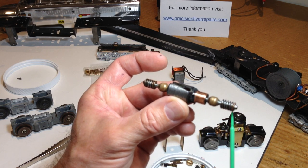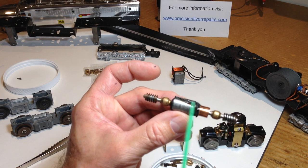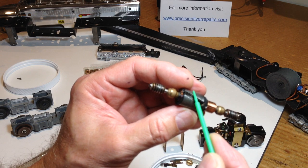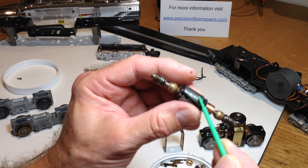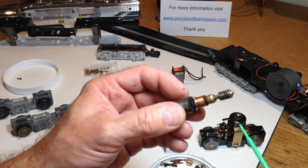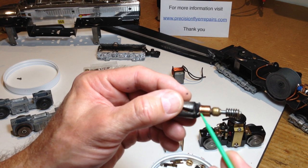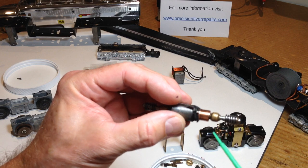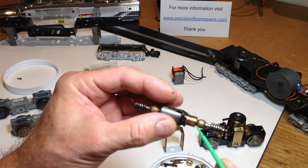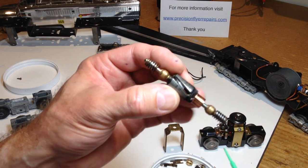The worm gears are held on each end by solder. You can slip them off, slide on a replacement bearing, reposition the worm gear, and solder it back into place. These are the armature's winding segments wound with magnet wire, properly attached to the appropriate post corresponding with the commutator segment, with gaps to prevent short circuits. These connections should be positive, the gaps should be cleared, and the commutator plates should be clean and shiny. That is your American Flyer diesel armature.